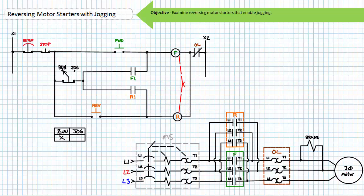As you'll recall, paired contactors and reversing motor starters with interlocks allow selective reversal of an industrial three-phase AC motor by interchanging applied phase sequence. The interlocks serve to prevent simultaneous closure of the contactors and direct phase-to-phase contact. Interlocks could use mechanical, electrical, push button, or a combination of methods.